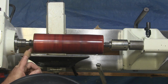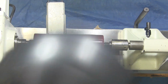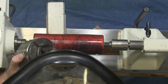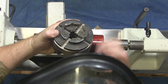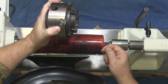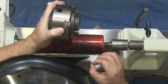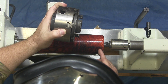Okay? You'll see that I'm not true here. Now when I make my tenon, oh, my face shield is dirty. When I make my tenon, I'm going to actually use, now I own an Easy Wood chuck with dovetail jaws. This is a Stronghold chuck, and if Ernie had his Vicmarc here, I'd use it. I'm using this one because it's got a flat jaw, or a flatter jaw. And when I'm cutting one of these peppermill bodies, I don't want to waste wood at the tenons because I don't want to take any more out of there now than I have to, because I want to have room for that for later. In case I wanted, oh gee, I cut that dovetail a little too deep.